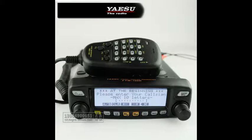There. I just used the radio to disconnect, I think. Let's make sure. File, connect, disconnect unavailable. Yep, we're disconnected. I did that by holding down the star key in Wires X mode. And let's take it out of Wires X mode. I don't know why it wasn't letting me connect using the connect menu. It usually does. But of course, since I'm doing a demo, it had to act up. So anyway, that's another way of making a connection.